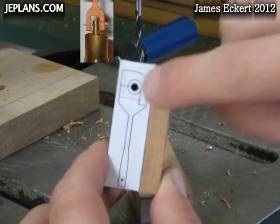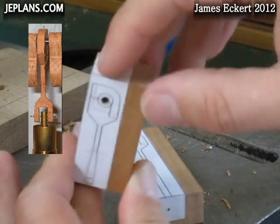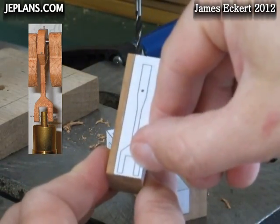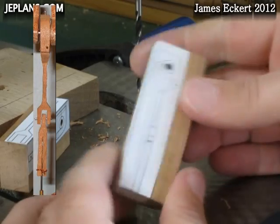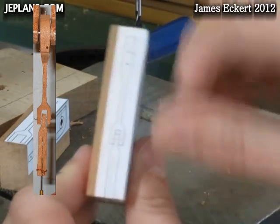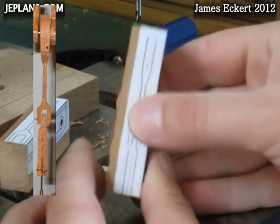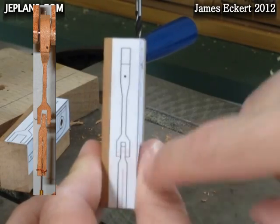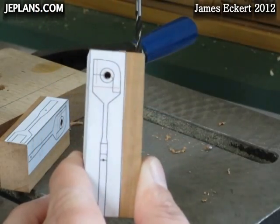I've drilled out that 1/8". We used the small bit to drill just to that depth from the top, then drilled through for the attachment to the piston. This is the connecting rod for the displacer — it's going to be hinged right here. We've drilled a hole out in the bottom that's going to go on the displacer shaft, and we're going to make a cut on that same spot so we can wrap something around it to pinch it onto the displacer shaft. We've drilled out the top in the same manner — the 1/8" for the crankshaft.